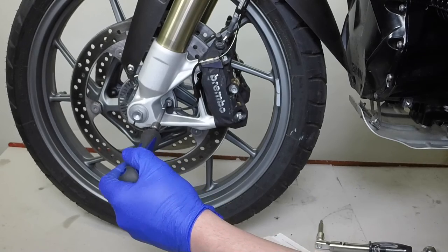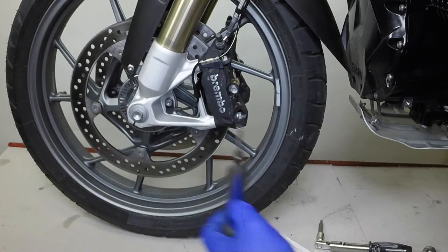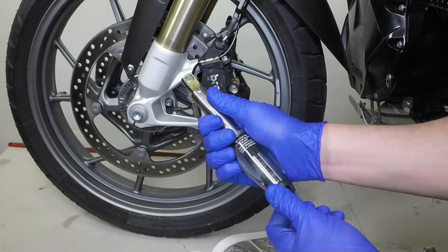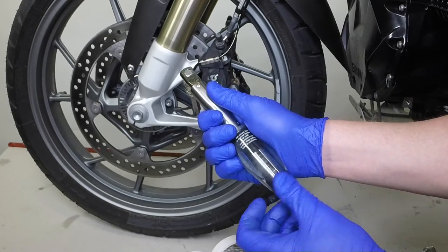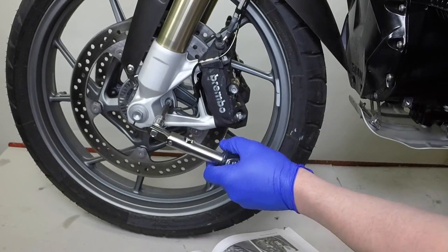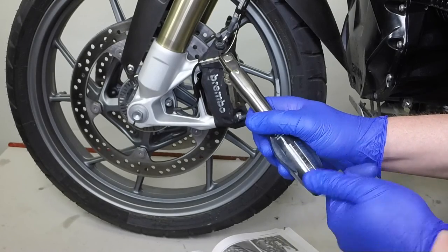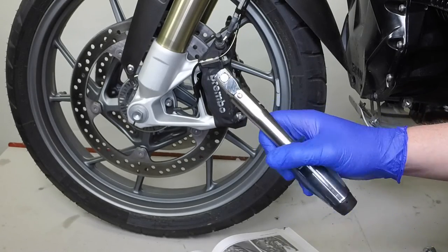You're likely to use a smaller torque wrench with a screwdriver bit. Tighten the screw lightly by hand, then set and lock the torque wrench and apply the specified torque. Reset the tool to the beginning of its scale afterwards.